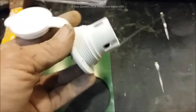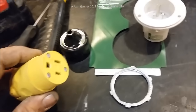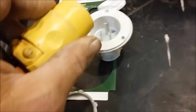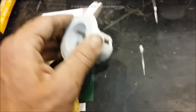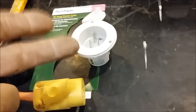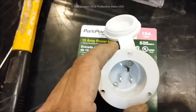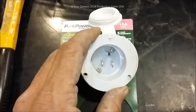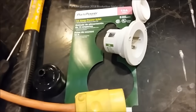This is designed to mount into the wall of my RV. A six-foot cable will go from my pickup truck — where I have a 3,000-watt inverter, a pack of batteries, and solar on the roof — to my camper. I can drive down the highway with a 305-watt refrigerator load keeping it cold on the electrical side. I do not recommend running propane in your refrigerator going down the highway; it can blow the flame out, the electronic ignition may try to refire, and that area fills up with gas. RVs are not built that well, so when they blow up they really make a mess.